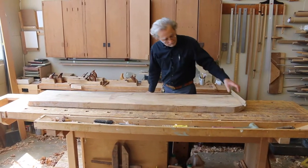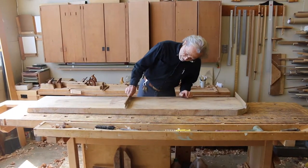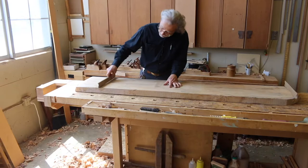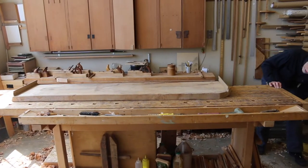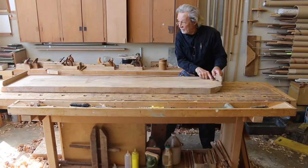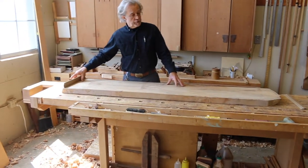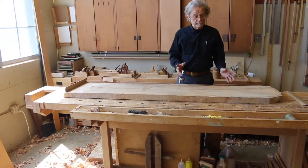Take a look at your board. Let's see how much cup we have — you can check it along the way. This one has some knots and burls in it, so there's tension in those spots and it's lumpy essentially where those are. I flattened this off a little bit just to see how the wood works. You can scope that out and then set your winding stick to either end and see what your twist is like. This is sitting on a high spot here but as it sits it's parallel. So what I'm going to want to do is flatten this out, check it again, and make sure it's parallel — that'll be my reference plane. I'm going to put two reference planes, one at either end, make those parallel, and then straighten the board out in between those two points.